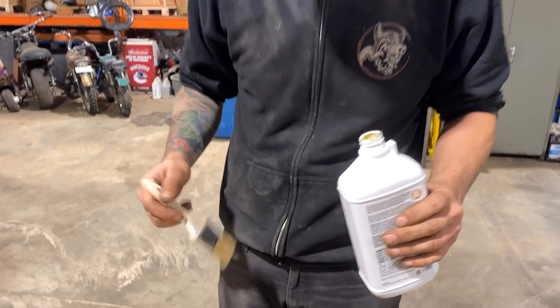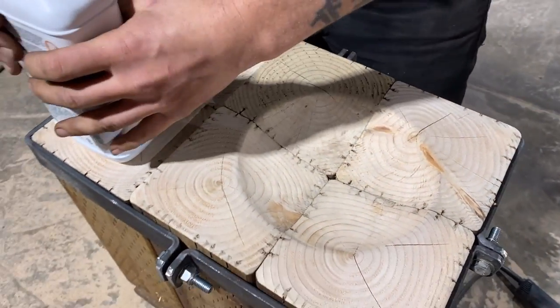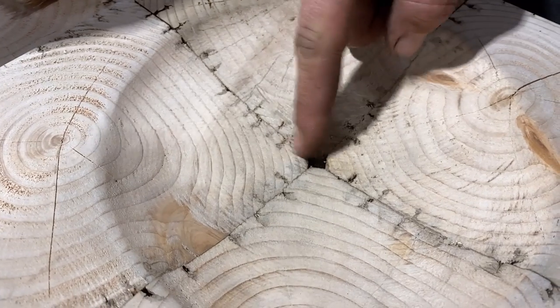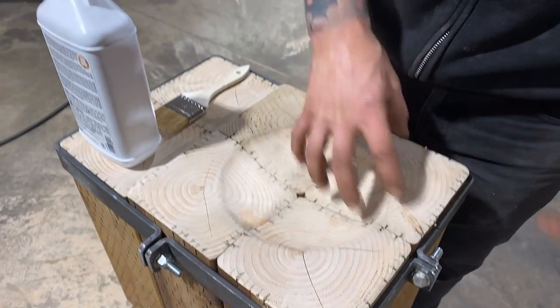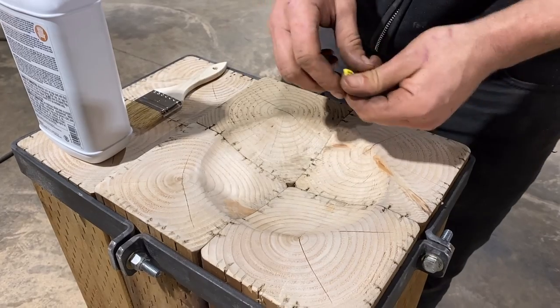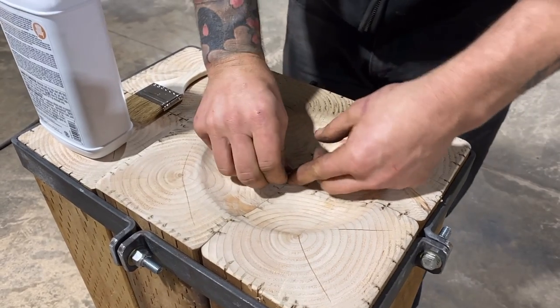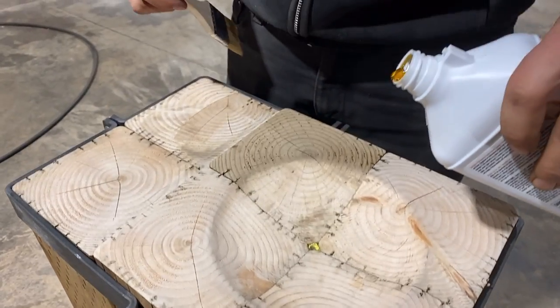Okay, so boiled linseed oil. There's probably a bunch that's gonna go right through that hole. I can guarantee that. I wonder if I should stick something in there. Maybe a little piece of tape, hold on. She's asking if the hole in the bottom of this right here is going to be an issue. Like, is that gonna mark up what we're hammering? I suppose if you slammed something right dead in the center there, then perhaps, but mostly when we're using a shrinking stump like this, you're hitting along these edges and you're holding your metal and hitting at an angle into there and making your tucks. So this little hole in here isn't a big deal, but I just don't want to leak a bunch of linseed oil down there. So I'm gonna just jam a piece of tape in the hole just so we're not leaking a bunch. All right, here we go.